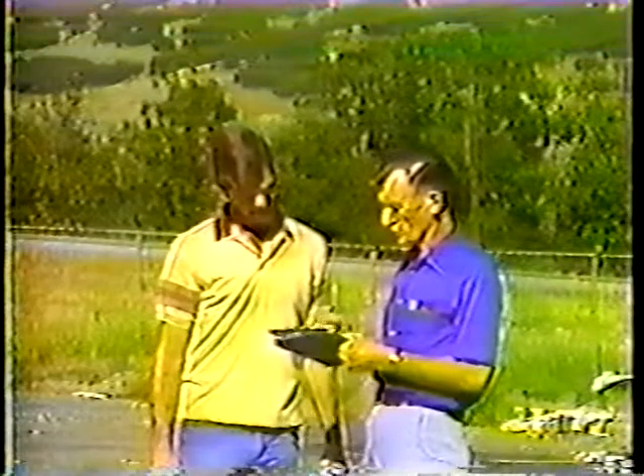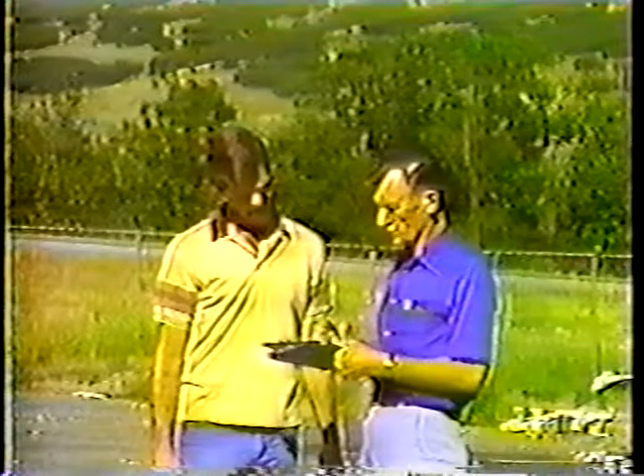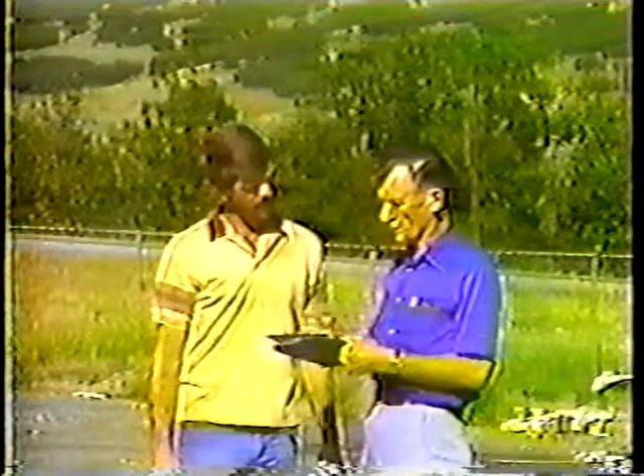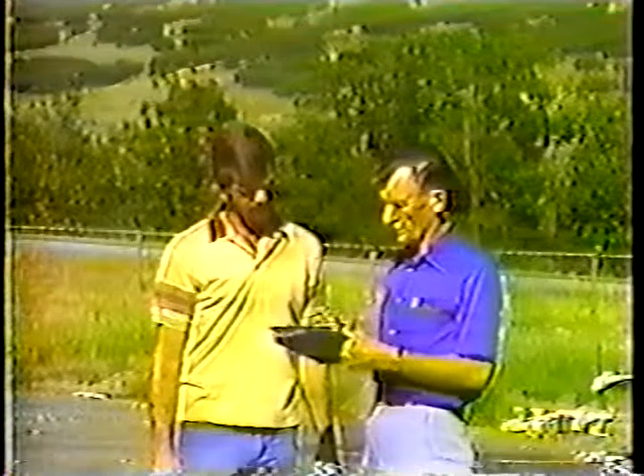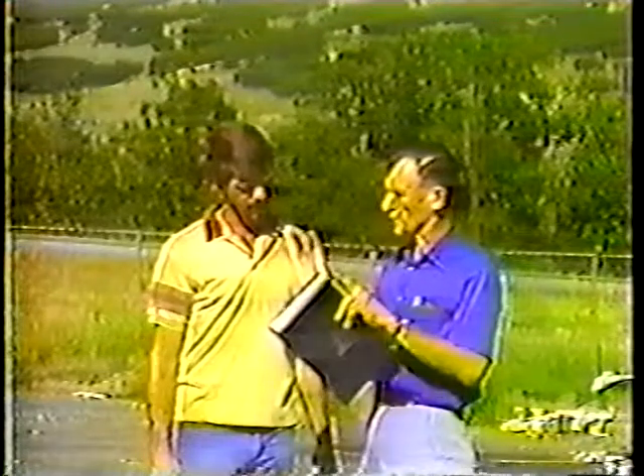When you set the gate, be sure to use a tape measure because some of the scales marked on the sanders are inaccurate. Always set the tape measure on the floor of the sander. The next step is to set the chain speed at two and count the number of shaft revolutions in one minute. This step calls for starting and stopping the chain at exact times, so be sure to discuss the hand signals you'll use before going any further.